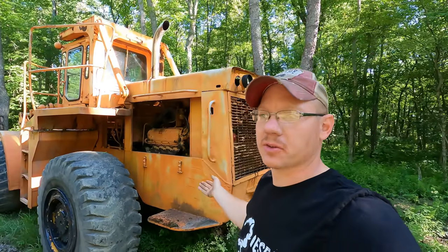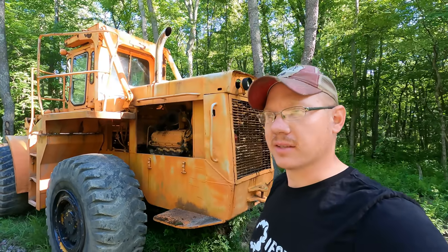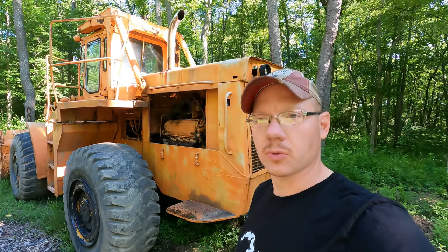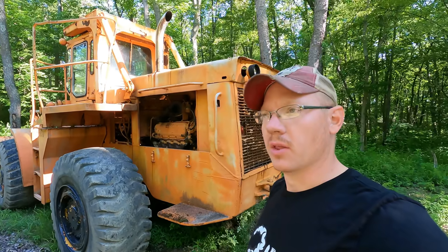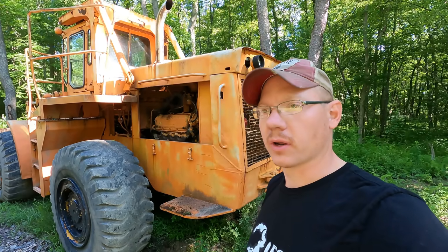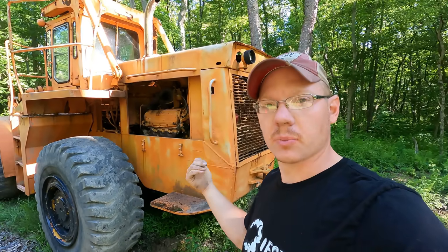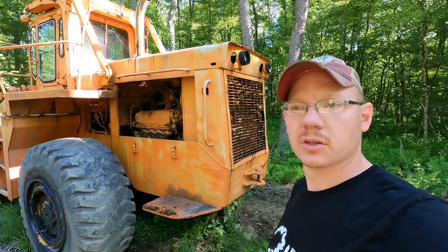So it just had to be water in the fuel system, because I just cranked it for a second and it popped right off like normal. And it seemed like it ran good until I started coming down the driveway here and it started losing power. I was able to move the little something I needed to real quick, which is all I really wanted it for, but it just barely made it off the driveway to this spot. So those fuel filters are most definitely clogged up bad with either dirt or water, and I'm guessing quite a combination of the two. So I got us two new fuel filters and some injector cleaner and some heat we're gonna put in that fuel and try and clean it all out real good. And yeah, we should be stellar.